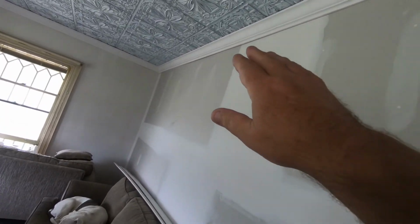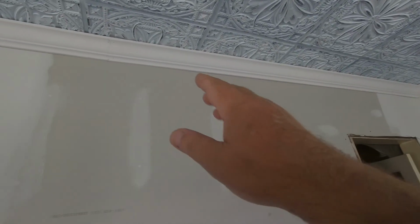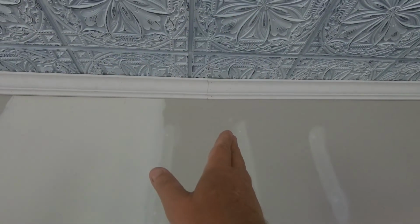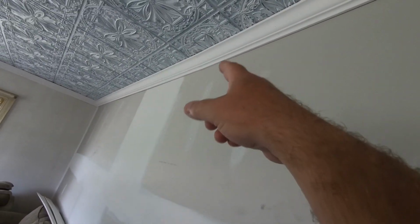This first piece went up nice, went up tits. The second piece that laps over the first one is a 45. Measured it up, cut it, coped it, did one cut on there. We brought it in and dry fit it. I was on the cope end, he was on the lap end, and he said, oh man, that thing fits perfect. And being on the cope end over here, if you look down, it looks like it's freaking tits, man. So I said, all right, we snotted up the nailers. I started popping pins in here, handed him the nailer, and he finished popping pins in over there.